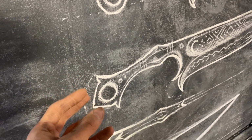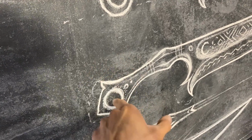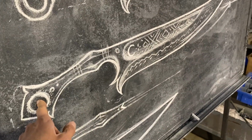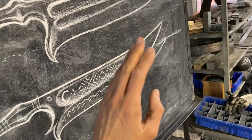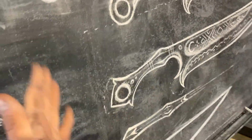So in my mind, I feel like we should get the pommel end roughly forged to shape, maybe drift that hole in now with a Coal Iron Works punch, the same ones we use for our hammer eyes. Get it rough, but then leave it rough, and then forge the blade almost to perfection, nearly so it's ready for grinding, and then go back to the pommel as maybe a last touch. So that's our plan.